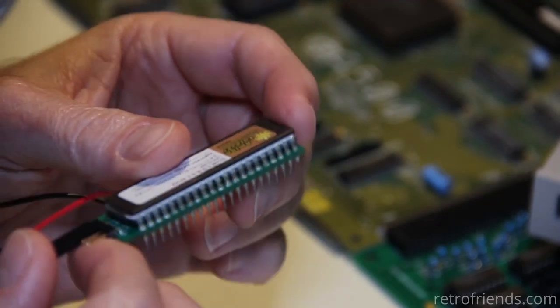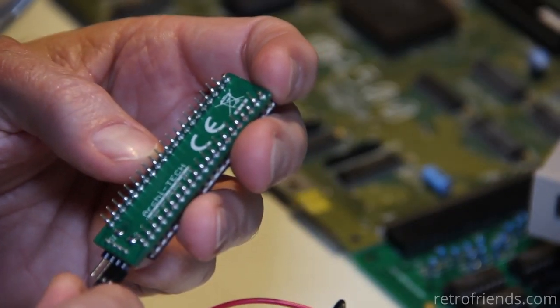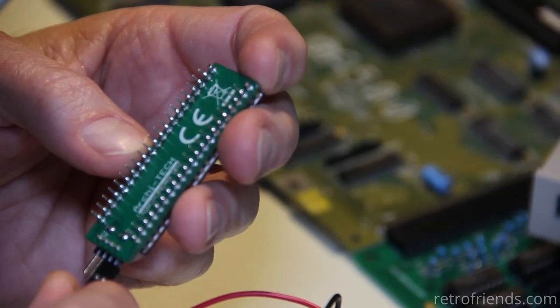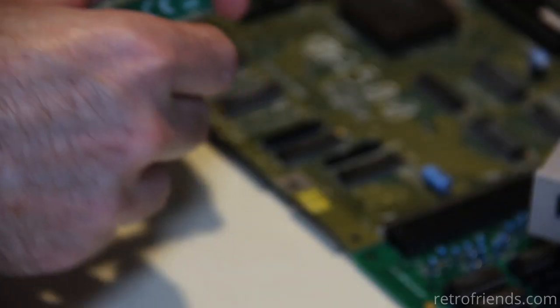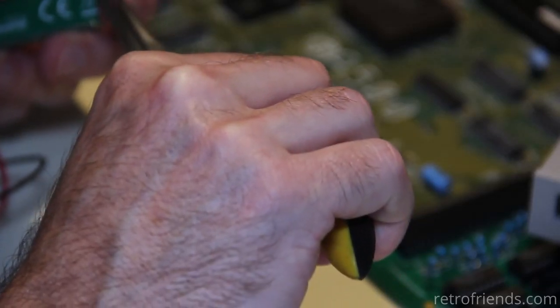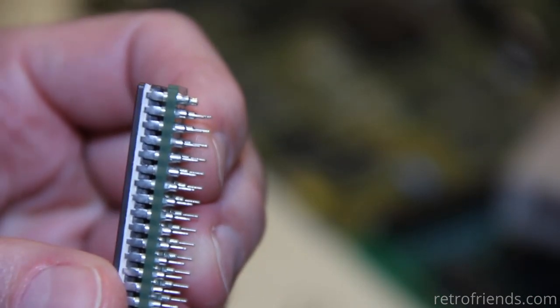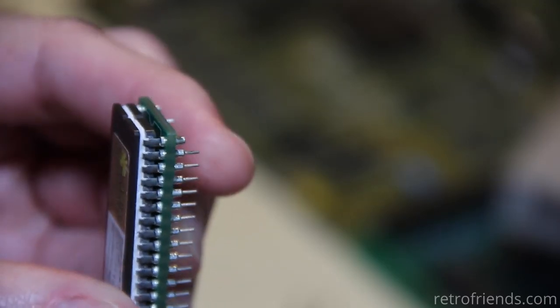It's on the A18 position right now. Is this some sort of thing for the oops bug or something? You've got to be careful when you pull these out to try not to bend the pins on the end. This pin is actually bent - these are rounded pins and they will not stand up to bending. You can bend them once a little bit and bend them back, but if you bend them again they'll break right off. It looks like the two on the end have been broken off.